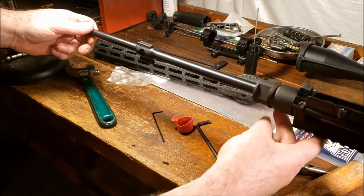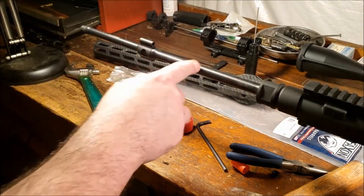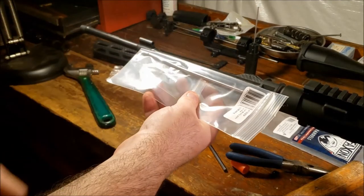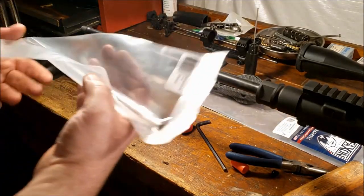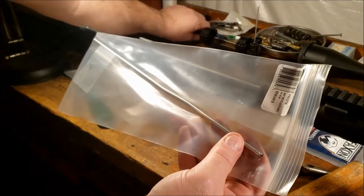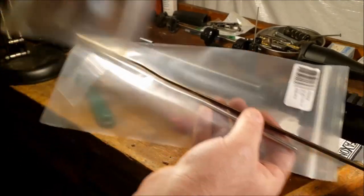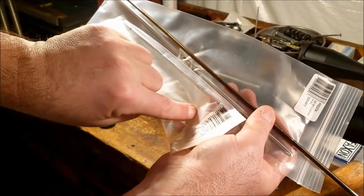Okay, also conversely, we probably need to do some more tuning and playing around. So let me pause one second here and I'll grab some more parts. Okay, those of you who are astute observers will note this is not a carbine length gas tube upper. This is going to be a medium length gas tube. You guys can say, how do you know the difference? Well, you have rifle length versus medium length versus carbine length, so what is that, 15 inches versus 12 inches versus 7 or 9 inches, something along those lines.